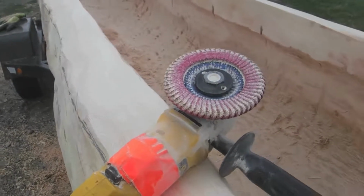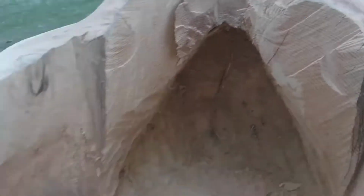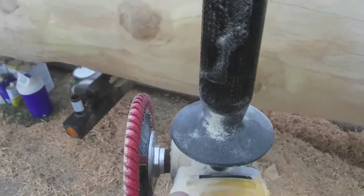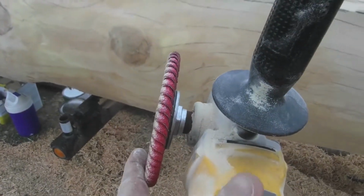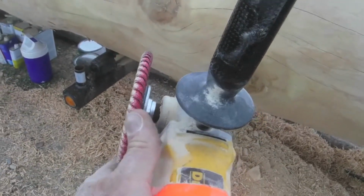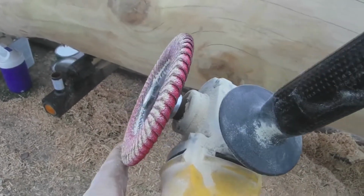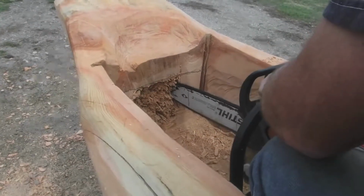Well, we've used quite a few tools getting up inside the bow today. Tom did a great job getting up in there. And I've been waiting for this disc because this is very special. It's made for a fillet weld to smooth out the metal welds and corners of things. And it's got a fully rounded blade. And that's what I need to do the fancy stuff I want to do. We also hollowed out a little pocket on the tail end to remove a few extra pounds there too.